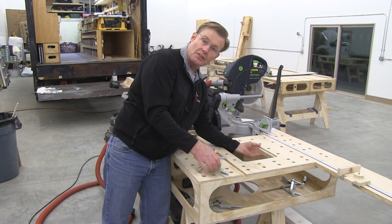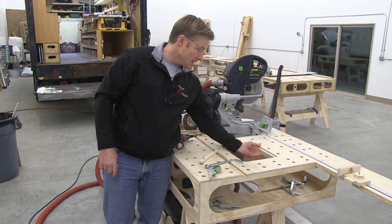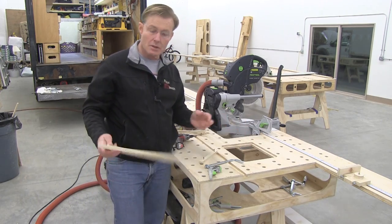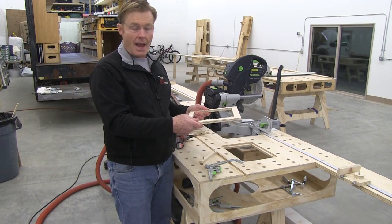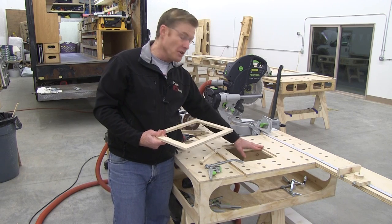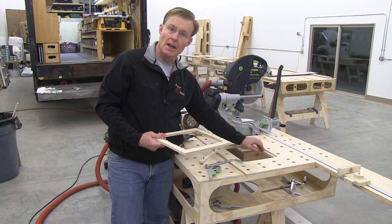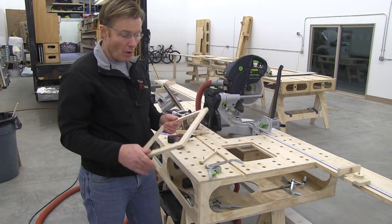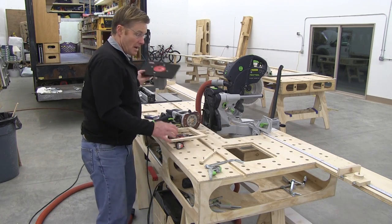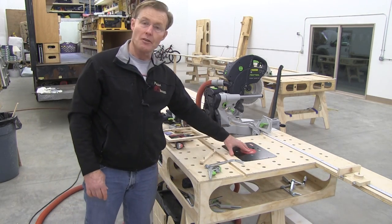I already have my backer board in since I did it to this bench earlier, but I would just clamp it with two clamps on each side — so eight clamps total — and let it set up. Alternatively, you could make that first cut all the way through, flush up the backer, clamp it, and wait for the glue to dry, then come back and make the dado cut. That might be a little safer. It's pretty thin — about an eighth of an inch or less when you make the dado cut — so you might want to glue and clamp it in place first, then route into it. Either way, you'll end up with a very consistent, very precise cutout.